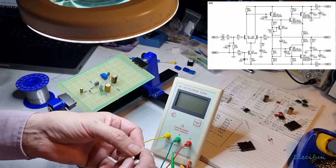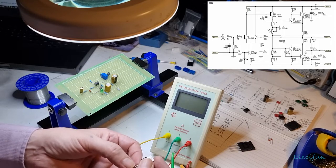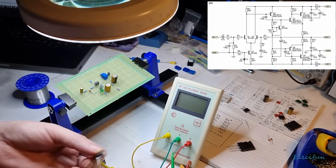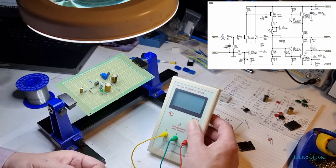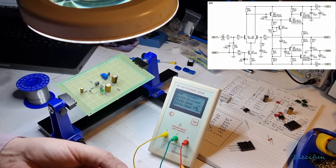base collector emitter. Is that the way it said it was? Oh, darn it. Base collector emitter, yeah, that was right, wasn't it? I'm going to double check. Hey, look. That's the thing about doing these, is check again. Especially if you had a bit of a rough weekend. A lot of people wouldn't bother, maybe. Base collector emitter. Yeah, so emitter's on 3. And we want to make sure that emitter is going to the positive rail and the collector is going to the 1K.